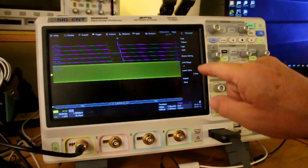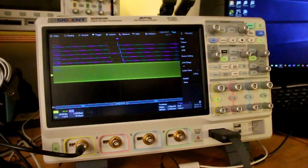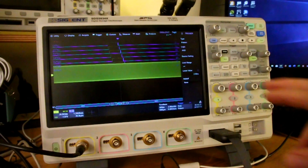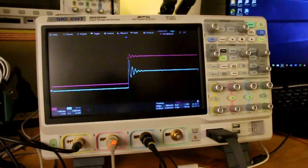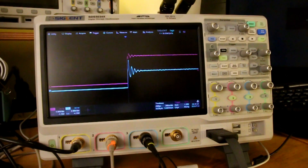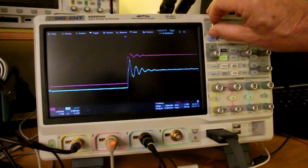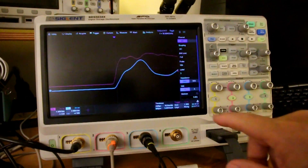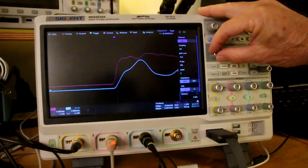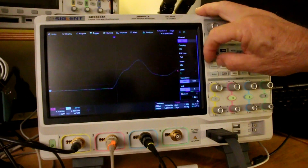With this pattern trigger it's pretty nice because you can have it exclude certain time zones. So if you have combinatorial logic which is in some weird state for a few nanoseconds as it's switching, you can tell the scope to ignore those strange states. A very interesting feature is the ability to set the relative skew between vertical channels. I'm sampling a digital signal on channels 2 and 3 and they're both connected to the same node, except that on channel 3 it's going through about 18 inches of wire. So given the speed of light, you can see they're not quite lined up in time. I can select that channel, go to the deskew, and in 10 picosecond increments adjust the relative skew between the two signals so that they actually do line up in time.